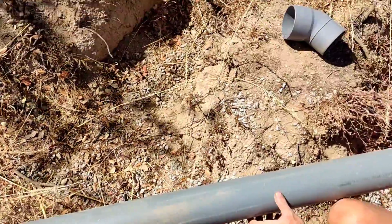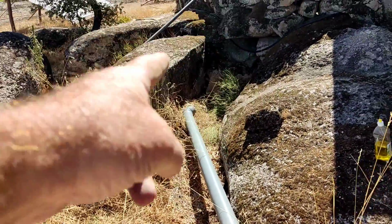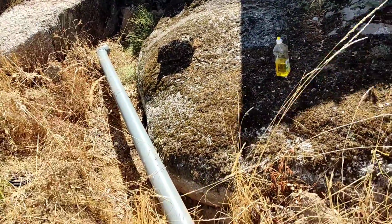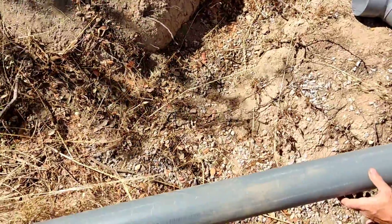And I don't know what I'm talking about now, but there you go. Once the pipe is set, we know the distance to measure between the two bends. We can measure it and cut that, and that's it. Job done. So it's basically best to just make it all up above ground before you actually bury anything or cut anything.